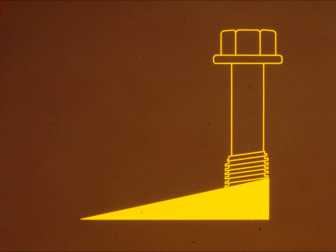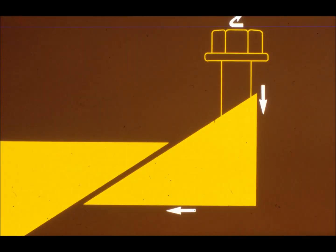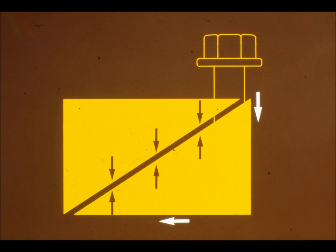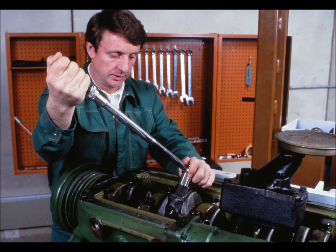To see how a torque wrench measures tension, imagine unwrapping the threads from a cap screw. The threads are nothing more than an inclined plane wrapped around a cylinder. The other threads — the threads the cap screw fits into — form an inclined plane also. So as you rotate the cap screw, the two inclined planes slide along each other and pull the cap screw down into its hole. As you keep turning the cap screw to tighten it, you stretch it, creating tension. The tension presses the two inclined planes together with greater and greater force, making it harder and harder for the planes to slide past each other. So the tighter you turn the cap screw, the more tension it exerts, and the more torque force it takes to turn it. In this way, torque is an indirect measurement of tension in the fastener — of how far the fastener has stretched.